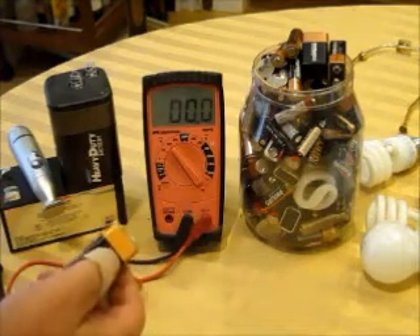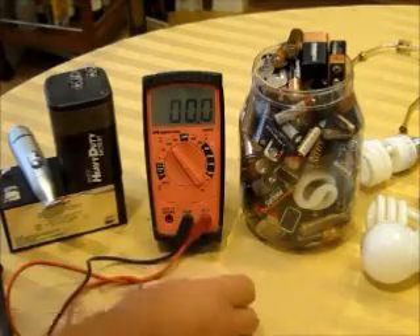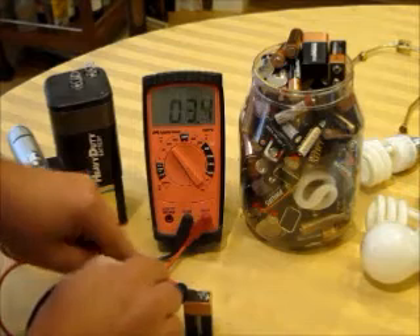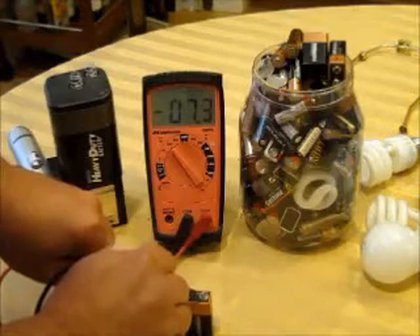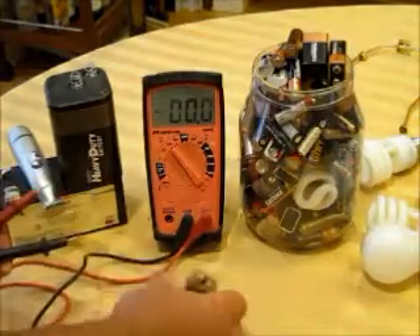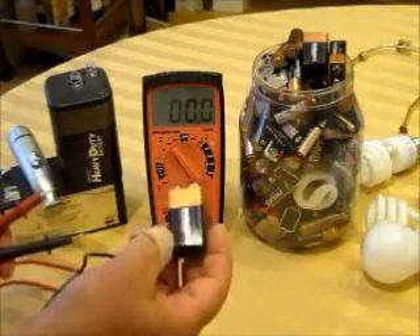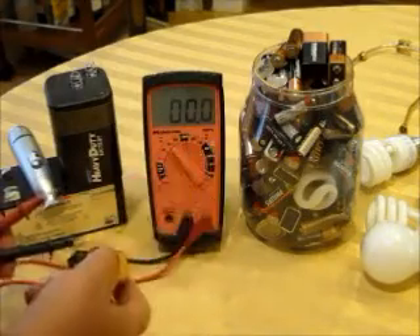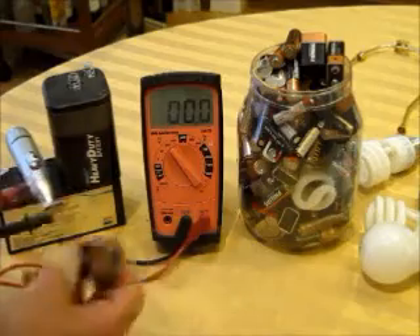Some stores take them for free. Here's a simple 9-volt battery. I don't worry too much about the polarity - I just don't care if it's negative or positive. It's going to give you the reading. That one's saying 7.4 volts - that's dead. That's a 9-volt battery, so I know it's time to toss. I use a lot of these in smoke detectors, and I'm not going to put a rechargeable battery in a rental unit smoke detector, so I'm stuck buying alkaline batteries. You can get them online really cheap, even cheaper than Costco.